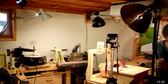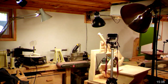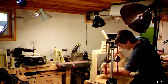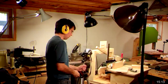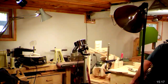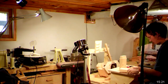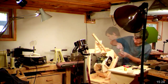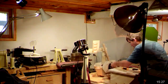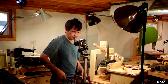Now I switch to my multiple mortise template, which is mounted vertically — a different orientation. Figuring out how that's going to align, changing the bits, and clamping some stock onto the table. Filming from different angles. The thing is cut but the fit is not perfect, so I'm trying to figure out what's going on. It turns out I have some slight inaccuracy in my pantograph that I still need to work out. What I ended up doing is cutting these with a little bit of slack so they would still fit into each other, just for the video, because I didn't really want to investigate that right now.